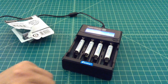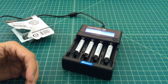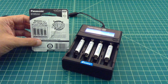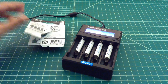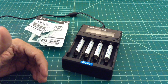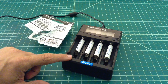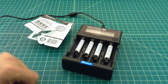These are rated at 800 milliamp hours, so that's more than 200 milliamp hours lower than rated — more than 25% below spec. One could argue these have been in storage for 10 years given the 70% retention claim, or that they haven't been burned in and need a few discharge/charge cycles. That may be true and I don't want to fully discredit them, but my experience with other batteries is that they're not off by 25% right out of the box. So a little bit disappointed in this particular batch of Eneloops.